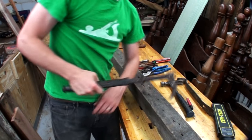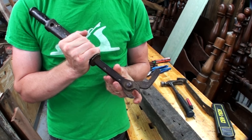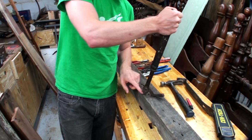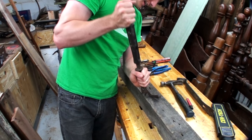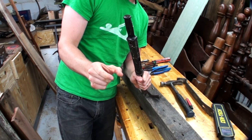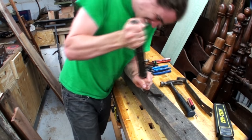Let's take a closer look at how the nail puller works. It's a heavy steel tool — you slam down on the handle, which drives the jaws down around the piece of metal, they pinch, and then you rock it out. Put your hand down here, not up here or you'll slam your hand. You really need to slam it enough times for those jaws to pinch in on the metal. Sometimes they'll keep slipping off, so just keep at it until you've got it pinched enough. And there we go.